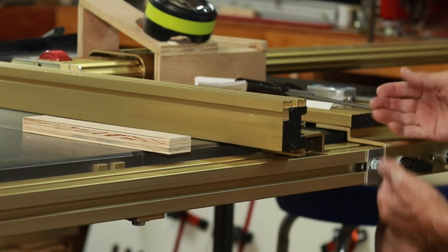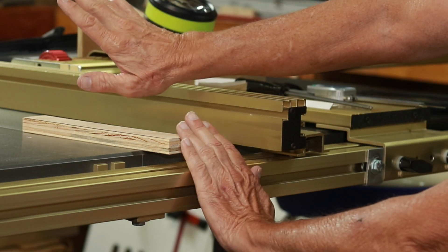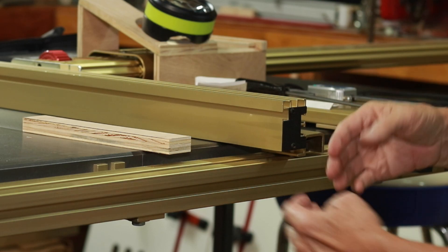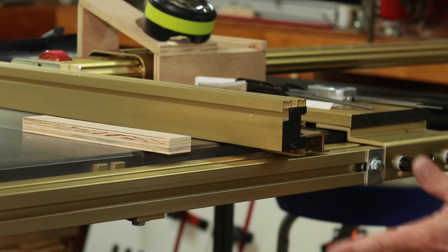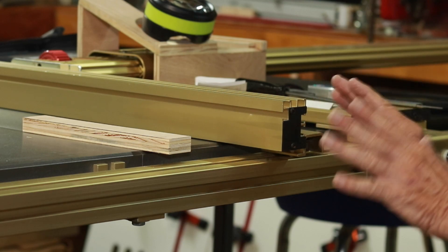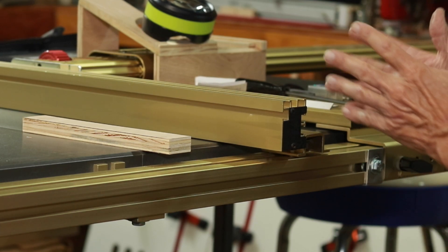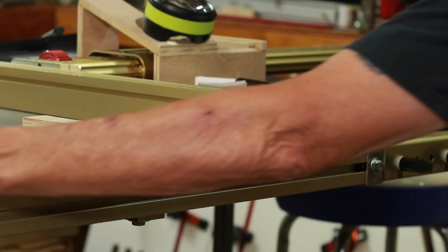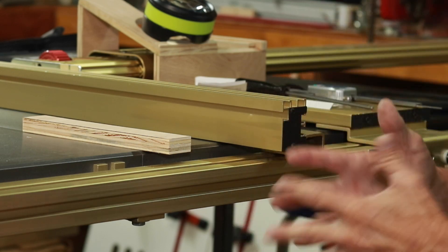Basically the bracket here — I had it too far out. So when I pushed this one against the bracket and against the rail, I pushed that side out when I tightened it, and it was flexing out. So I loosened the four bolts underneath. If I measured the outside of this rail to the outside of that rail and measured the bracket part, I was a sixteenth of an inch wider. So I tapped this in a sixteenth of an inch, snugged it as a good starting point, slid it back on, tapped a little more just to make sure there were no more variances, then began the realignment process for the third time.